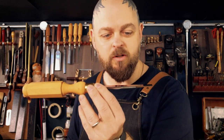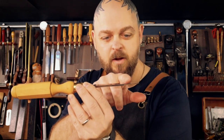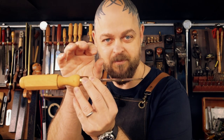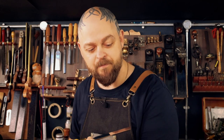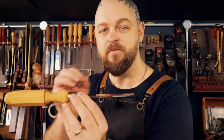With chisels, what you can do is very gently take a fraction of a thousandth of an inch off the central section. What that means is that when I'm polishing the back of the chisel, I'm only working on the front edge. Look at Japanese chisels and you'll see what I'm talking about. Anyway, onto the Scary Sharp system.